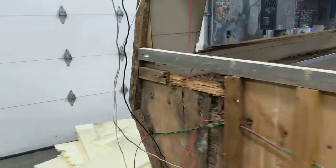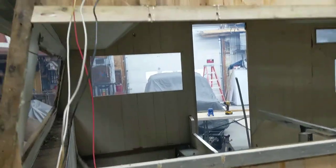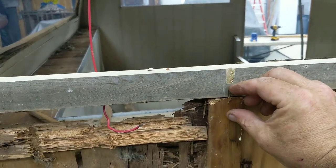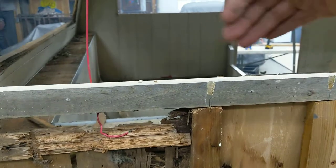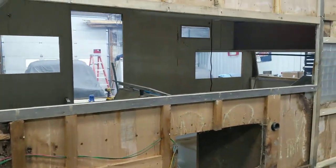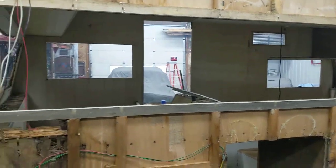I'll start in this area right here — I pick a spot and just start pulling the boards out. I have to cut the staples; there's a metal staple that they stick in between the joint, and I have to get in there with a grinder and cut them off. Then I have to cut the staples off that hold it to the paneling, and it's glued to it too. So it's quite the process to try and get each board out, but that's basically what we've been doing — just going around and taking each rotten board out.